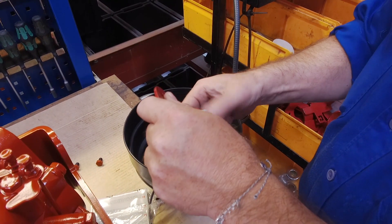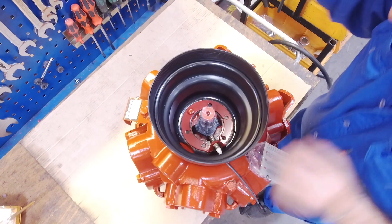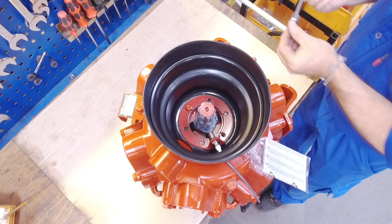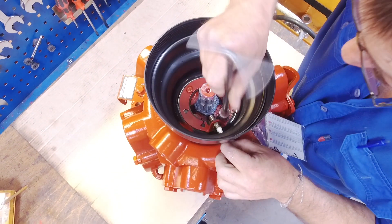The third component is the pump revolutions meter, which is fitted to the pump. A metal rotor is attached to the pump shaft and an inductive transducer on the red front plate. One revolution generates four pulses.